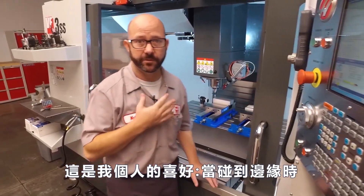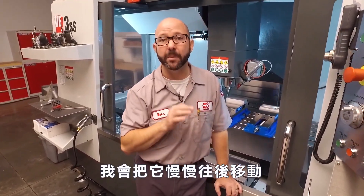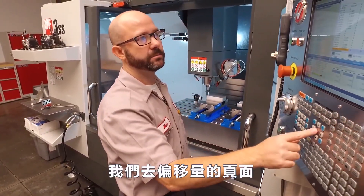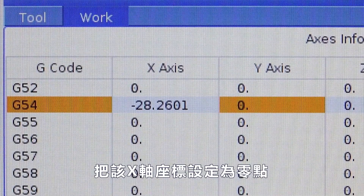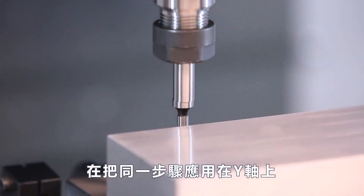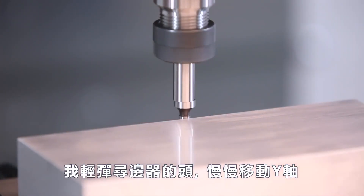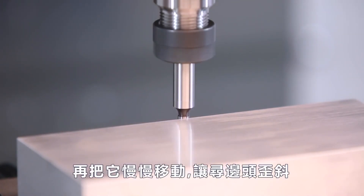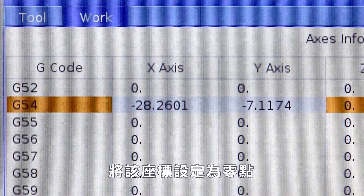This is personal preference, but for me, after it's kicked off to one side, I actually back it off by one click if I'm on a .001 increment. At this point, we've found the edge. We're gonna go to the offset page, go to our G54 work offset, and press part zero set under the X axis. Then we repeat this process for the Y axis — flick the indicator again, jog up against Y until it looks straight, keep going one click at a time until it kicks over, back it off one click, and press part zero set on the Y axis work offset column.